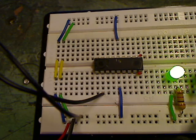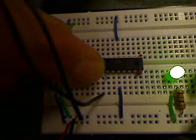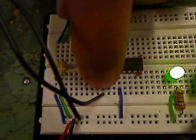So I'm going to go back to my pinout and see that the serial in pin, or C.4, is the third pin down on this side. I know what side that is because I've taken note of the notch here for orientation. So that's the third pin — I'm going to go from here. I have a 22K resistor in my fingers and I'm going to put that in there.